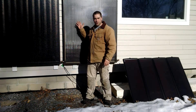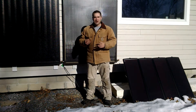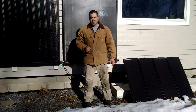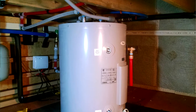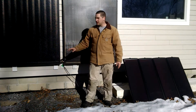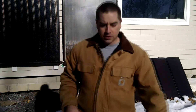The big three thermal collectors behind me have been doing an excellent job at heating the water. I think the tank right now just hit 120 degrees. The coldest that big 250 gallon tank has reached is 107 degrees, which is just great. I did add that little 20 gallon tank that I mentioned in a previous video, but that only now has to raise the temperature 20 or 30 degrees instead of quite a bit more than that. These guys have been working excellent. The garage just finished heating up — setting up the heat exchangers.